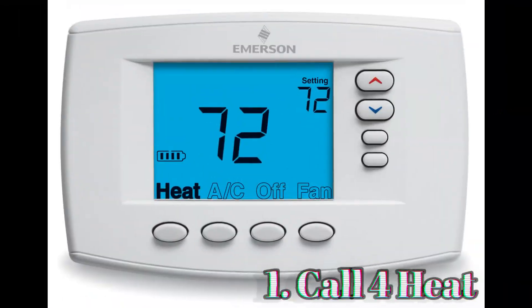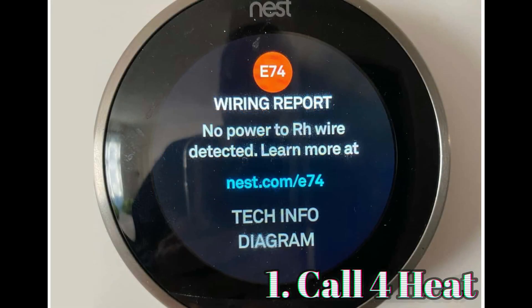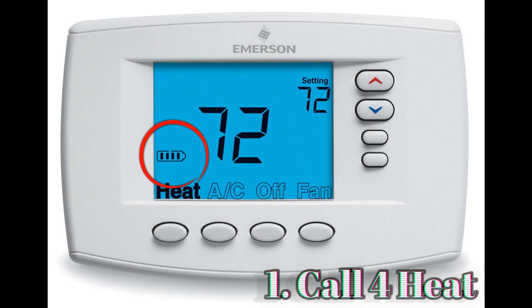Power, fuel, and a call for heat — those are the three things we need to check before we even touch the inside of the furnace. I like to go straight to the thermostat and check that I actually have a call for heat. Check the settings, make sure there's not a program running in the background, and if it's a smart thermostat, make sure there are no power issues. If it's battery operated, make sure the batteries are good. I have been out on service calls for every single one of those things, so check that first. We need that call for heat to be constant as we go along the diagnostic process.